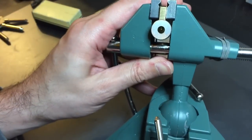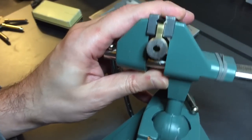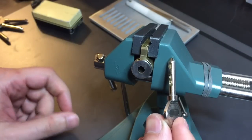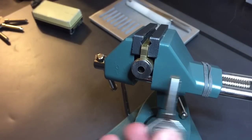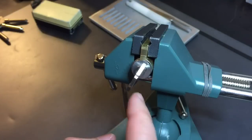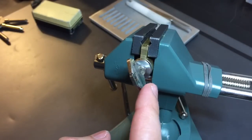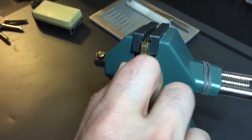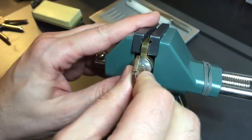As you can see, much like the Frayden lock, those key pins just hang down in that round keyhole. And then we have cuts on one side of this cylindrical key, which allows you to insert it in any direction. But the core will not turn until the key pins and the cuts on the key align, after which it turns like any other lock.